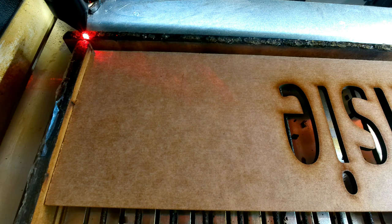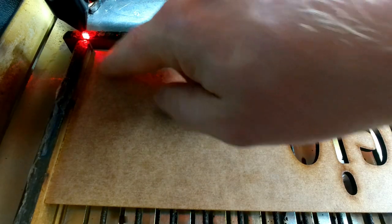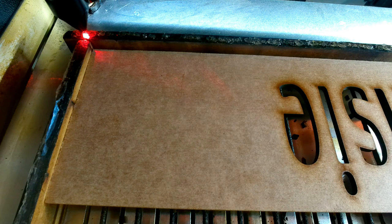So the second thing you're going to be able to do is engrave right at the edge of your material. If I wanted to engrave down here using a fill engrave, it's not going to want to do it because the machine's too close to zero and it really doesn't like it. So I'm going to show you how to get past that as well.